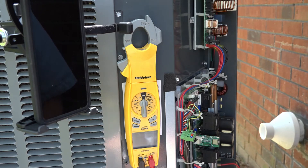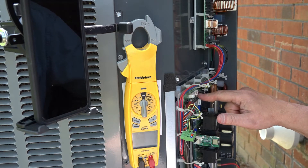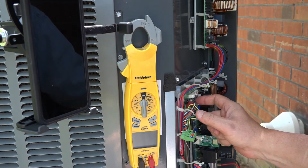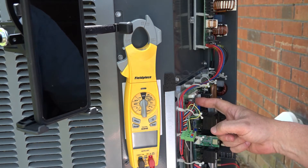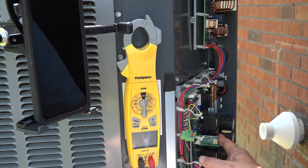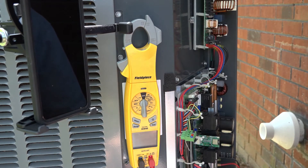After that's done, I come in here — I've got three buttons right below the digital readout labeled Learn, Recall, and Test. I like to hold the Learn button in for five seconds and then release it. What that's going to do is re-jumpstart the communication bus. It's going to re-share all the data off our programming chip back to the unit, so I make sure that I get good data transfer when I'm trying to reprogram this board.